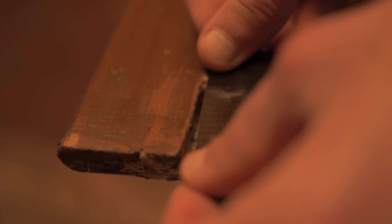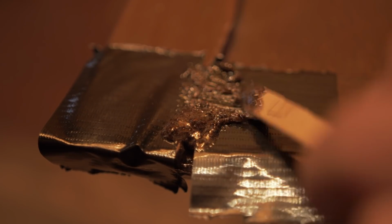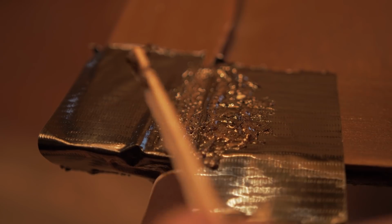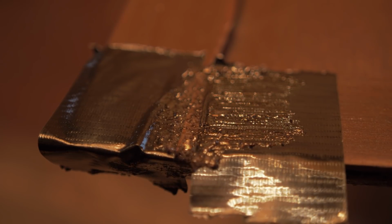This time I'm mixing mahogany sawdust shavings with the epoxy to fill any gaps between the hardwood strip and the door frame or the edge of the door. And obviously it's more in keeping, it matches much better with the wood stain on the door. And further down the line as well, I'll make sure to get the wood stain painted over this, and I'll sand it and paint it. But it's a nice little trick to keep it matching much easier.